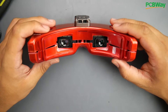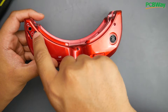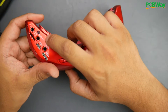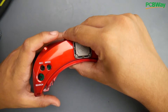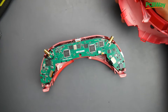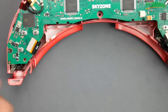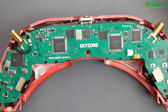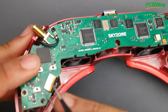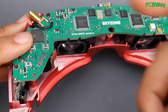The way to take this apart: there is no screw for the face plate, so just remove the face plate, and then you have three screws — one, two, and three right there. Make sure you don't mix up the AV out — it's right there by the AV out. You just get those screws and then just lift it up slowly and it'll come right off. You also have the fan connected immediately. It's really pleasant to take apart — that's one thing I really like about this. Taking a closer look at the way everything is connected, it also looks really well thought through, and they're using quality components. I really love this connector — it's the one found in smartphone screens. You just pop that up and then you're good to go. That right there is a proper connection.